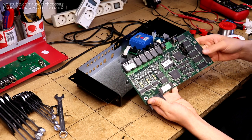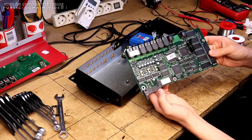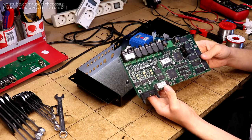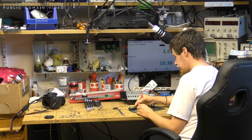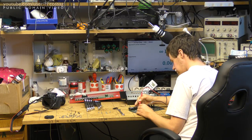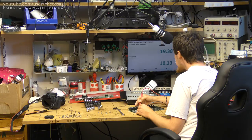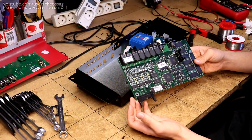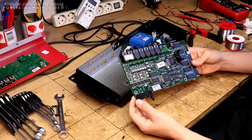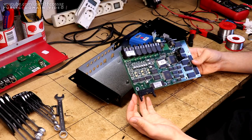All right, so that would be the firmware drum sound EEPROM, soldered directly onto the board, and that is what I do believe will fix the issue. I also gave it a bit of a cursory measure around. I checked all the capacitors. They all measure fine, as I would expect, since this is a kind of device which will see many rough times being moved around and thrown around, but it won't see too many hours of operation, and that's what generally wears your caps out. So yeah, I can't really see any real obvious faults with this thing.